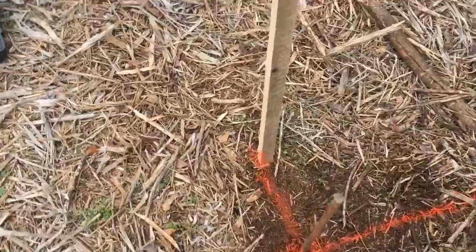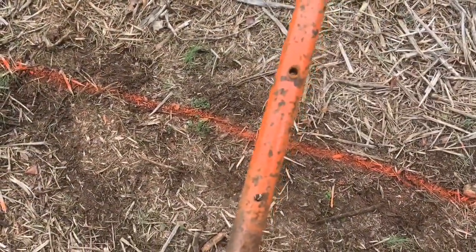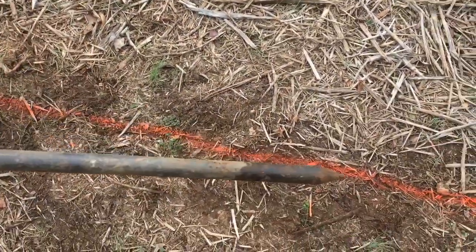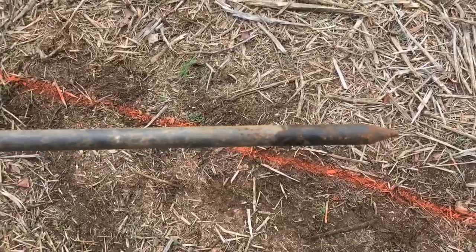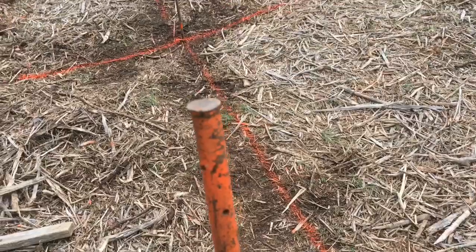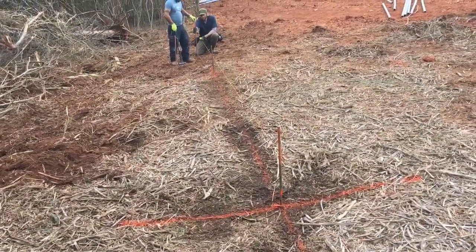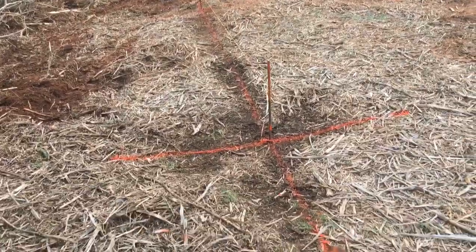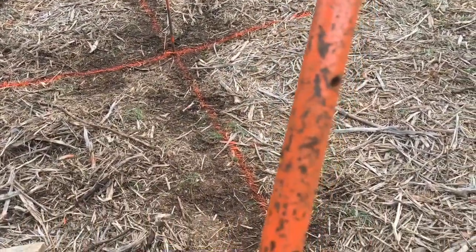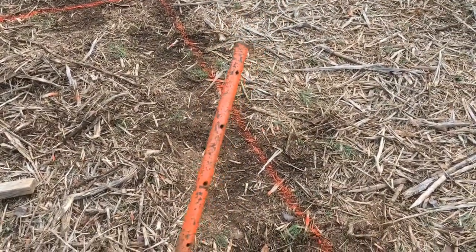So the next step is painting out the dig spots. If you're just a total noob, you may not know about this, but these are concrete stakes — and they're made out of steel. They're reusable. Scott and I have had multiple custody battles over these, but he ends up getting to keep them. He has full custody right now. These reusable concrete stakes are really nice and they have holes on them, so you can shoot screws in anywhere you want. You can get these at any big box store.